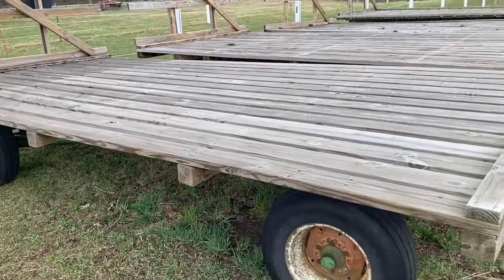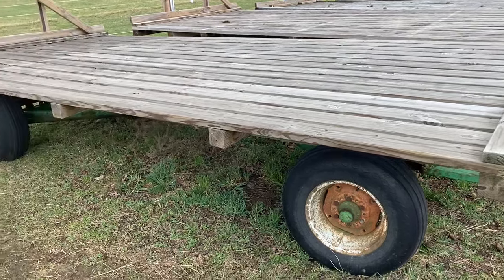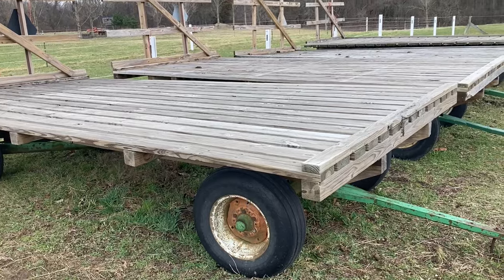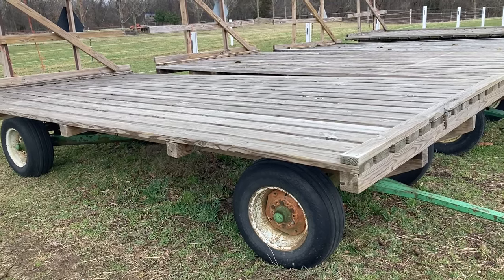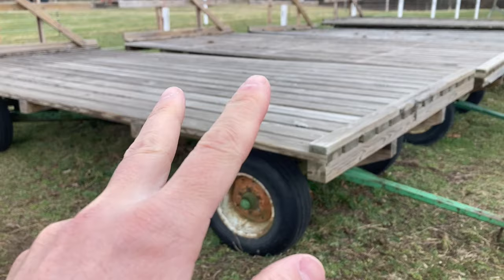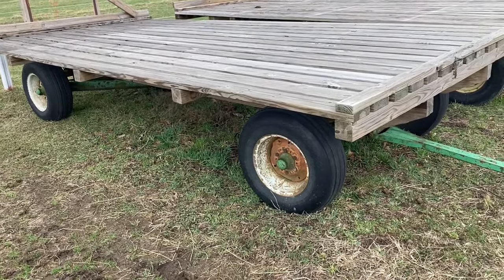Now let's talk about the deck itself. All four of my wagons, except for the little John Deere, are 8x16. That small one is like 7x15 or something. If I were to do it again, I would make it 8x18. I can get 100 bales stacked evenly on these if I go 5 rows tall in sections of 5 and get 4 stacks coming forward. There's a couple feet at the front after the 4th stack, but if I just had 2 more feet of length, I could get another complete stack and allow me to get 120-125 bales on the wagon.